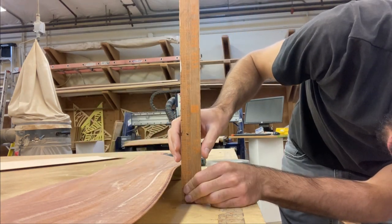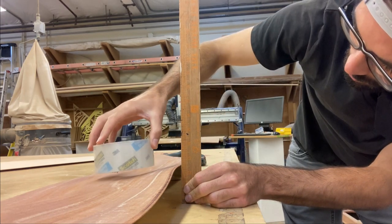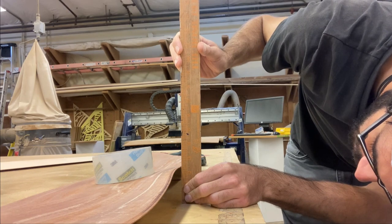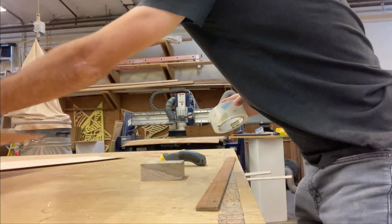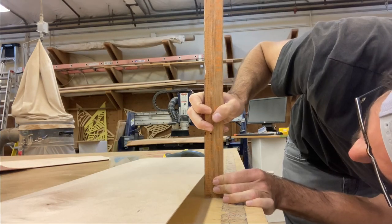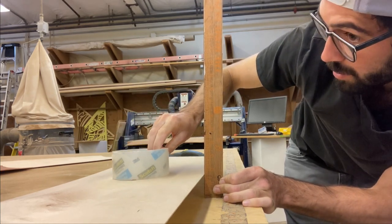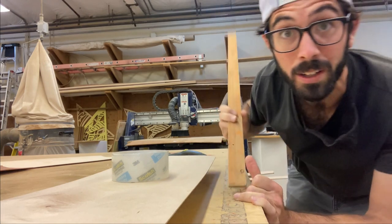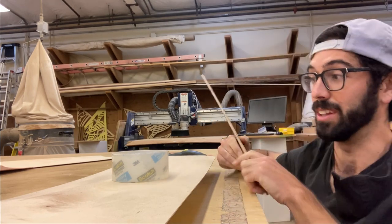All right, so we're at 2 9/16. And now we're at 2 7/16. So it dropped down about 1/8 of an inch. This is about 1 5/8. And this has dropped down to about 1 1/2. So they both deflected about 1/8 of an inch.